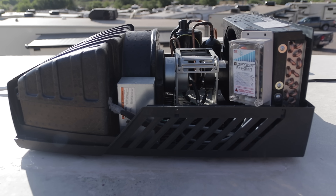The reason we're looking at installing the Micro Air Easy Start on our AC unit is because it's really the most advanced product I can find out there for helping your AC start and not have a massive draw of energy in the beginning. You can do some start capacitors and a few other things that kind of help take the edge off, but really this is the one that gives you the most performance — oftentimes being able to decrease that draw in the beginning by more than 60%. So when you're trying to run your AC on a generator and you don't want it to stall out, this is the device you're looking for.